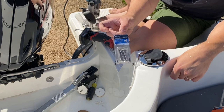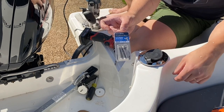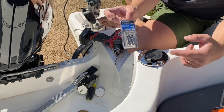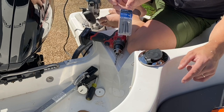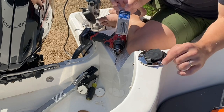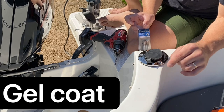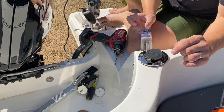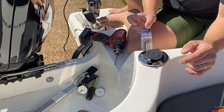So we're ready to drill for the screws. I have three number-14 by two-inch screws — I think inch-and-a-half would be enough, but I wanted to make sure. Stainless steel, and I'll put those in with a hand screwdriver, but first we need a pilot drill. I've found it works best to use a little wider bit to get through the fiberglass, and then use a smaller bit closer to the screw size through the plywood, so we don't chip out the fiberglass.